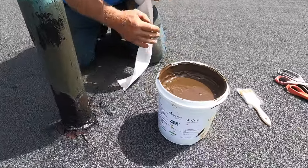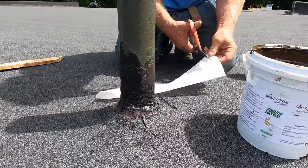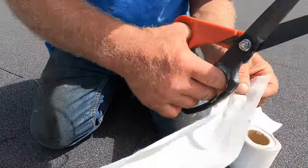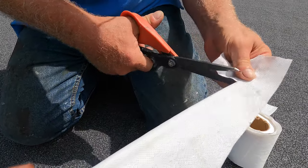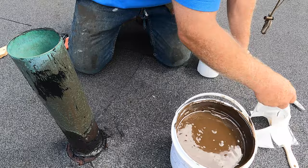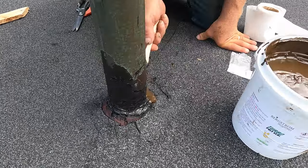If you're going to do any flashing, you take yourself a fleece, wrap it around to get the right size like that, and I cut the tabs like this — halfway to the roll. It's a four-inch roll and I'm going to cut it halfway. And this is how you do it: you paint a coat of Turbo Poly Seal around the pipe like that.